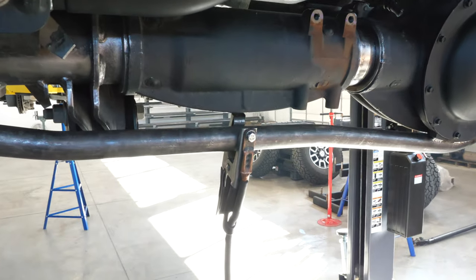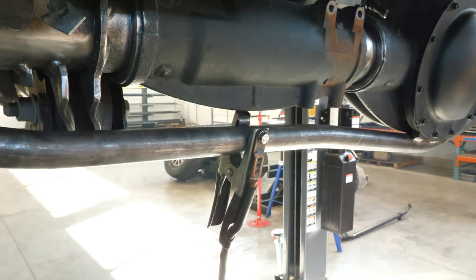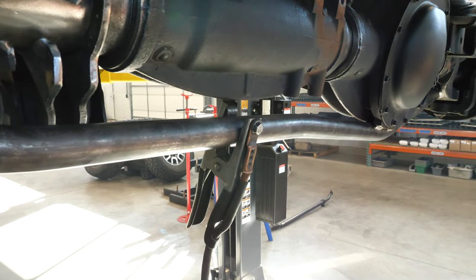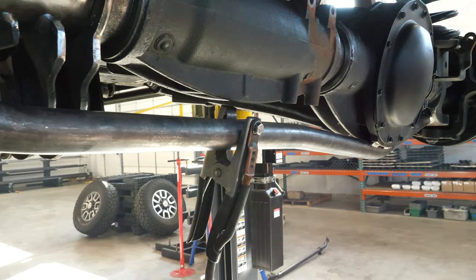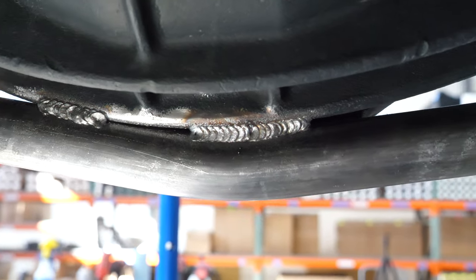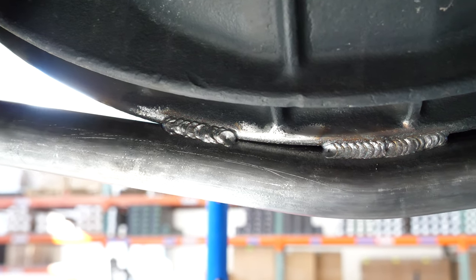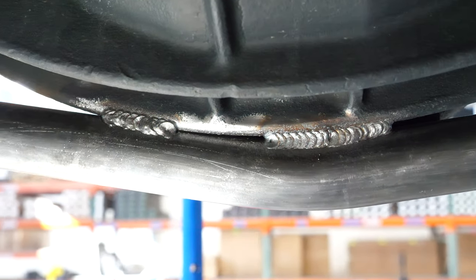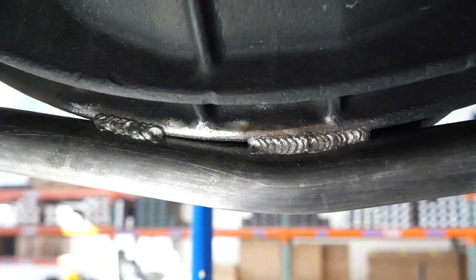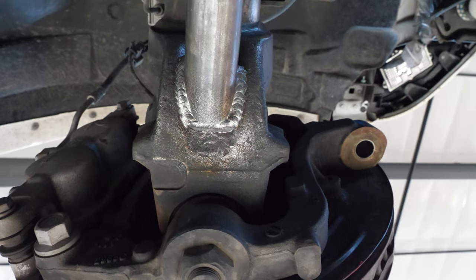You might notice we've got a ground right on the tube. I did not unhook the batteries, though I'd probably recommend that you do. As long as the ground is close to or on the actual material you're welding, I've never had a problem without disconnecting the batteries — take that at your own risk. Right now we're just getting heat into the diff. That cast and the tube won't weld well until it gets some heat in there. We'll probably end up with about three passes total — first pass fills the gap and preheats, one on the bottom and one on the top.